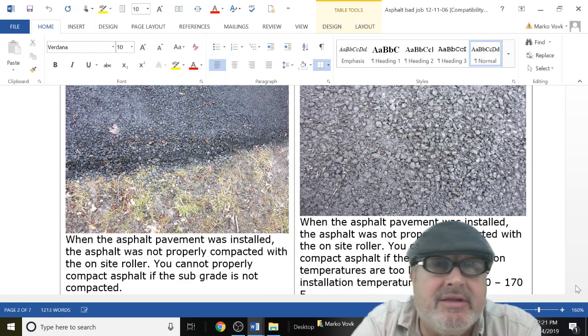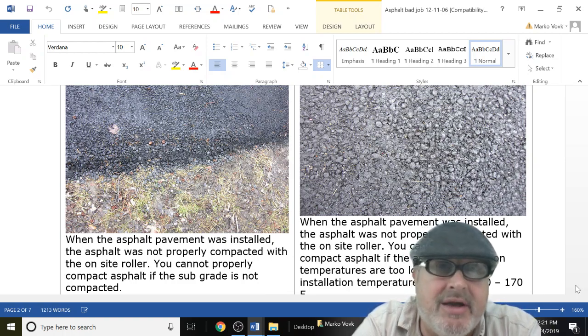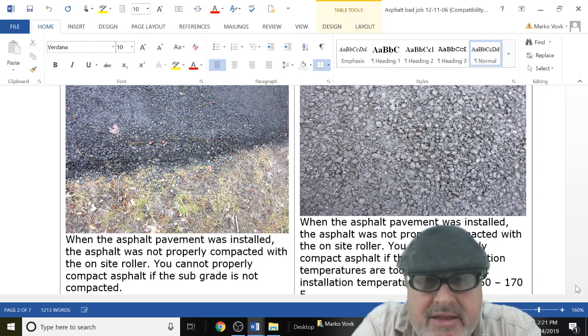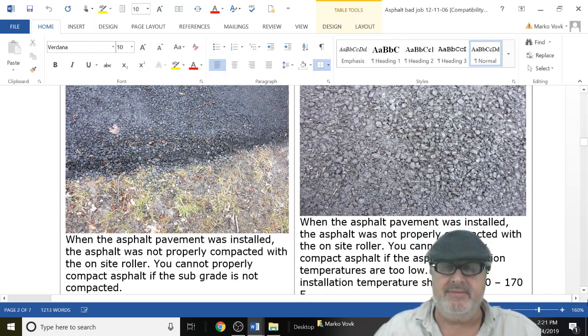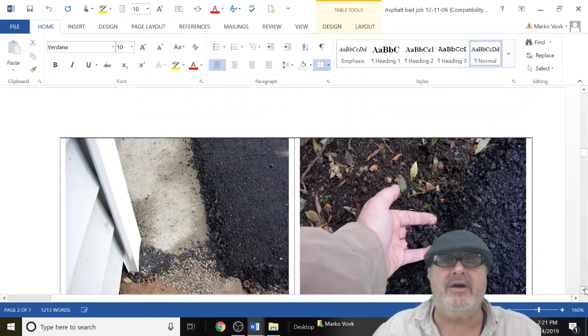And then you want to ask them, what about the mix design? Say, hey, was this the normal mix? Is this a mix that you put on top of concrete? Are we going to do two layers? Are we going to do a 404 and a 402? Are we going to change aggregates? And generally, they're not going to do two layers. Okay, that's mostly for road work. But you want to know what the mix is, explain the mix and make sure it's durable. You know, maybe that it's got a good yield, that it has some strength to it. Okay, and then we talked about the temperatures, and so you want to know how they're going to compact it as well.